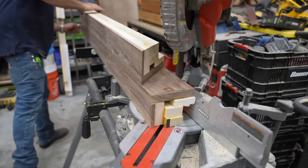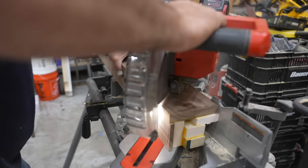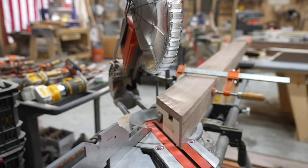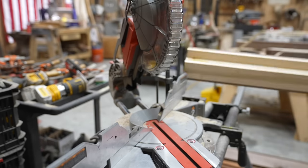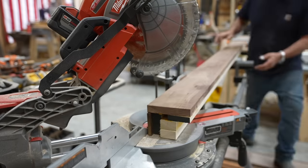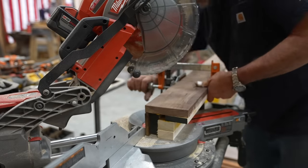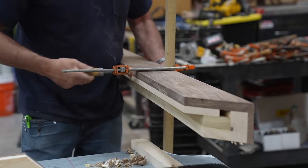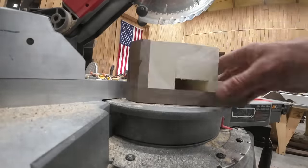I was getting really good accurate cuts with this Milwaukee chop saw. These rails were so long and so heavy I had to hang them in space, and I used a stilt at the end of each cut, clamped to the chop saw so nothing moved while I was rolling through it. You see there where I'm putting the stilt on it just to keep it all level.